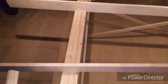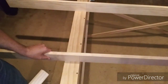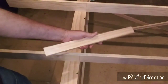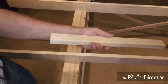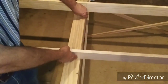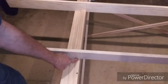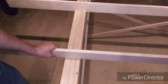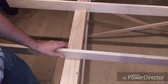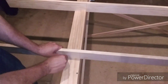Setting the joists themselves is pretty easy. The mark at the two-foot section is going to line up to the inside edge of the L-girder. I'm going to use a spacer stick — 17 and a quarter inches long, just a piece of scrap. I put that into place, make sure it's flush, and that ensures my joist spacing is proper. I can see I'm lined up here on the back edge of the L-girder. Then I take and draw a couple of little marks on the back end to show where the joist is going to sit.